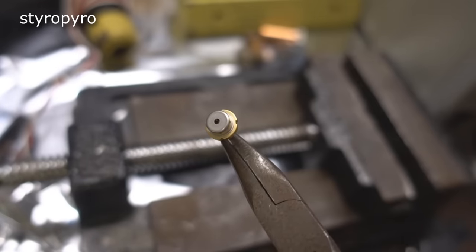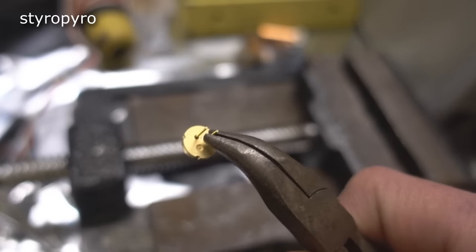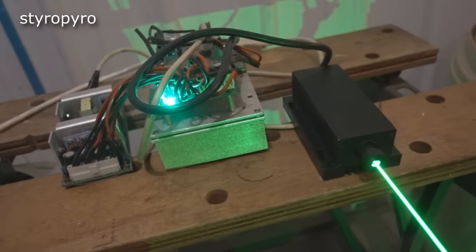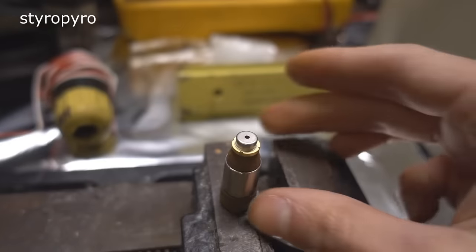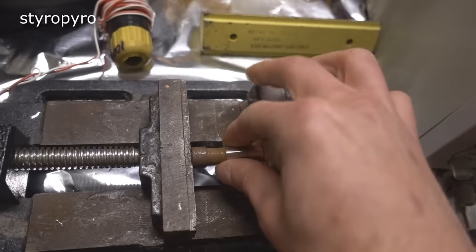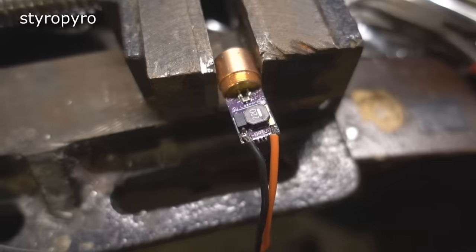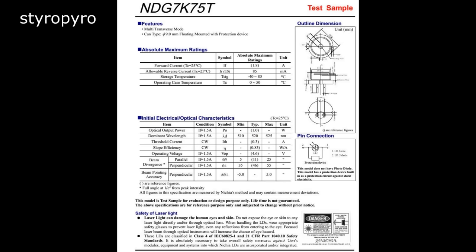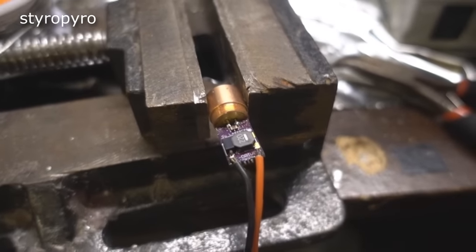Right here I have the Nichia NDG-7475 green laser diode, which is the brightest laser diode that can still be jammed inside a laser pointer — this is the future right here. Just to give you an idea of how fast laser tech has evolved, this is the kind of setup you'd need to match the output of this little diode just five years ago. Running it bare would kill it in seconds from waste heat, so I pressed it into a heatsink, making a tasty laser diode sandwich. I soldered it to a tiny buck driver for current regulation. The diode is rated for a max of 1.8 amps, but I'm pushing my luck and feeding it 2.3 amps, giving about 1.4 watts of output power — downright terrifying for a laser pointer.